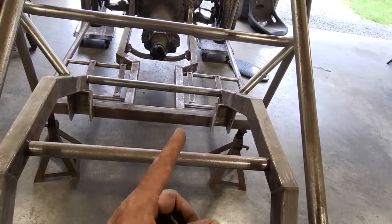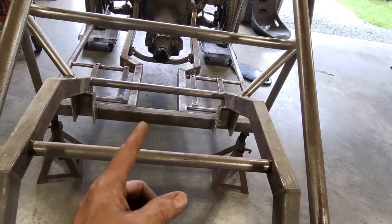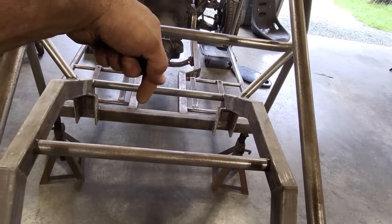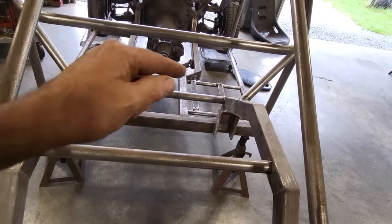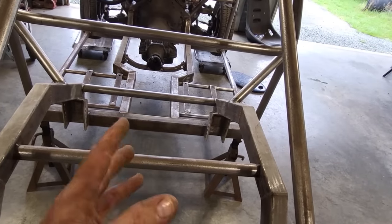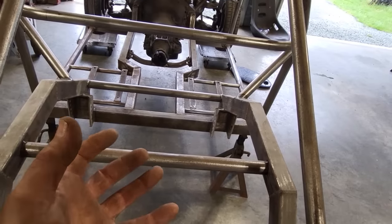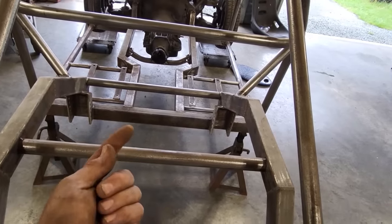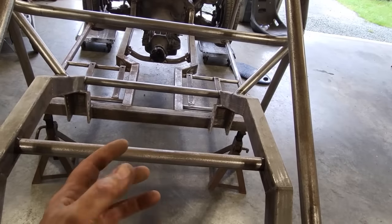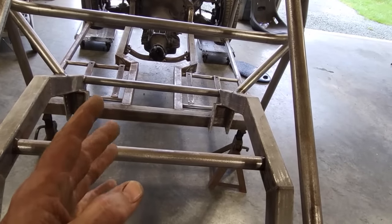I'm going to cut the bottom first because that's always the hardest to do. I'll always cut the hardest stuff first. I'll cut the bottom, and then I'll cut the inside here, and I'll cut the top here, and then I'll just have it so I can cut straight down through here. This will be the last cut I make. Always look at it when you're cutting out steel like this. You're just thinking, where's the hardest spot to get? And it's down here to cut that off down there. So I'll do all that and have it so the easiest cut I got will be my last cut.